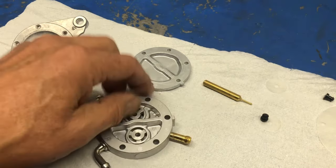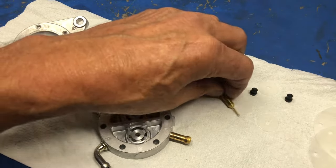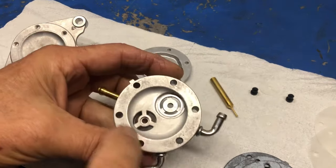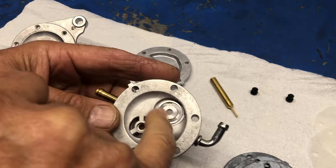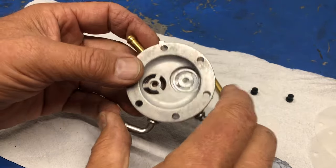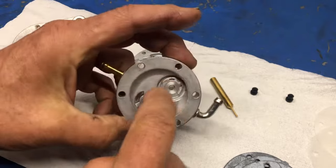So next thing I'm going to do is need to take inventory of all the parts. I have the two valves laying here, they're kind of hard to see, the two diaphragms, the two rubbers that hold the valves on, and my four gaskets. So now it's time to put this together. Oh yes, and I've examined under my viewer that there isn't any damage to the seats on here, the same on this side. Especially important to check that in this one, since it was mishandled for sure, because they put it together backwards, so who knows how they took it apart. So we have to make certain that these surfaces are perfect.